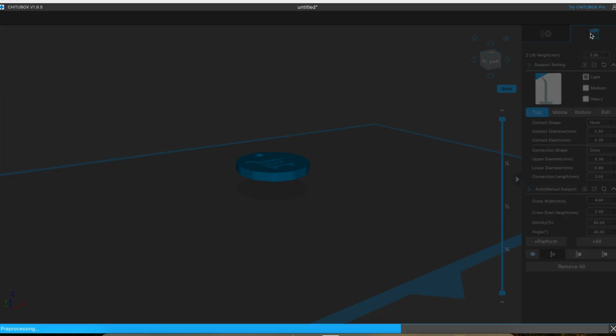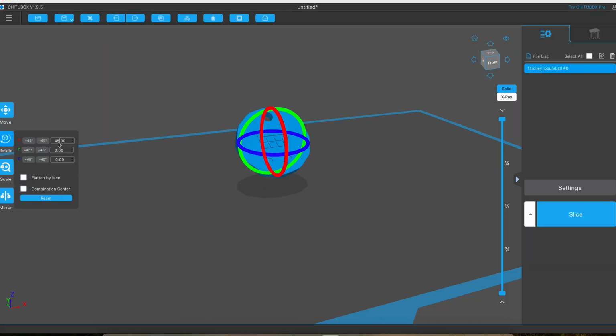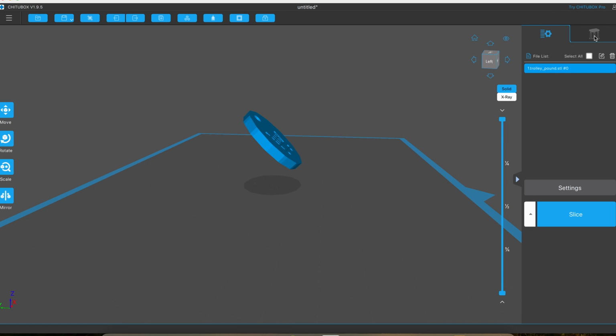Things should be supported. It seems obvious, but everything you get to print is supported. If you raise off the bed, then supports are needed. The Chitubox auto support feature is great and I've had no problems. Print things on a 45-degree angle. It improves the quality. And it also helps avoid problems. It does make the overall print taller and therefore slow, but it's worth it.